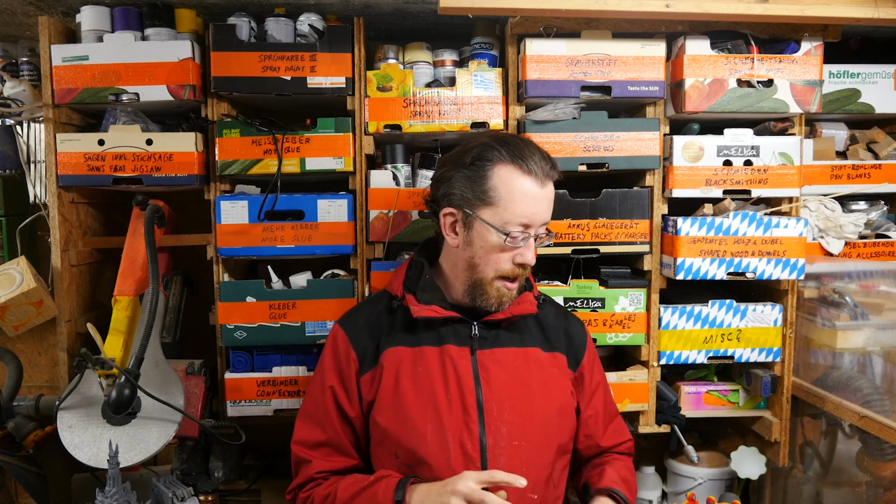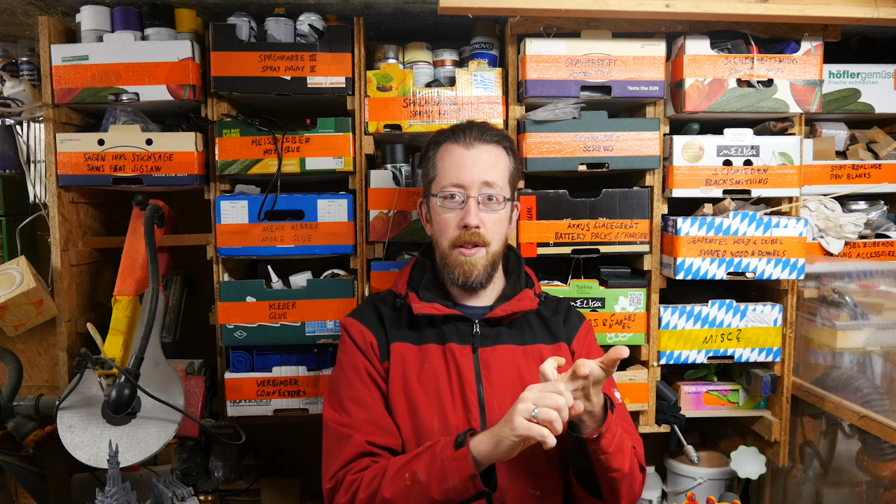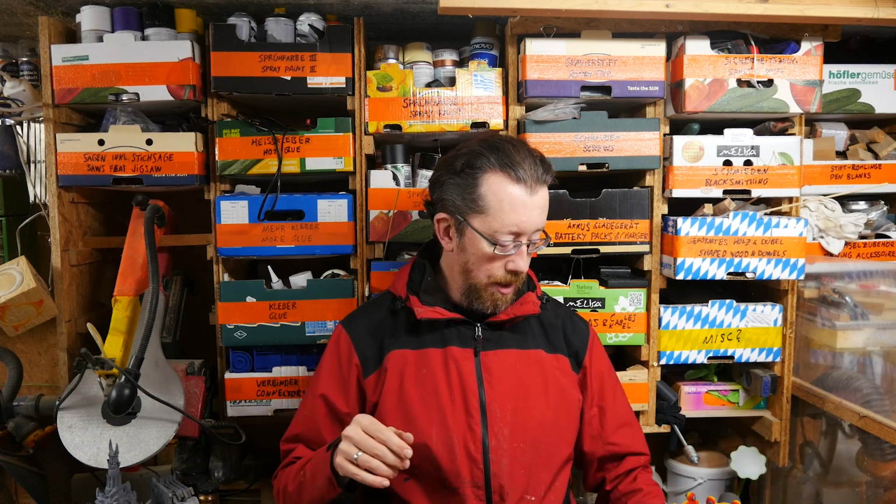So now when I need dust collection at some point, and frankly, I think I had 10 connection points or target points in my first design. I basically use it for the table saw, the miter saw, the bandsaw, and the lathe. So there's 4. And 2 are on the same line, which means there is a slight need for blast gates, which I can operate manually. So right now I have a system with 3 connections, and I use these manual ones that also allow for some flexibility. They don't need energy and make my dust collecting life in the shop very easy.